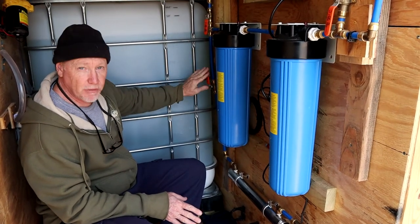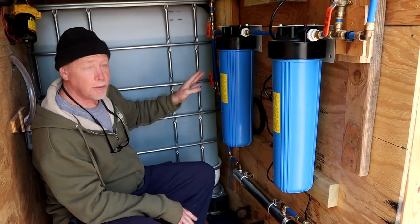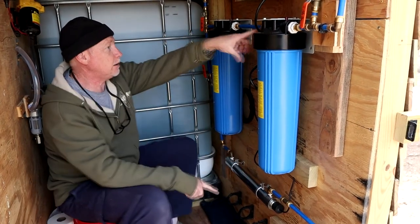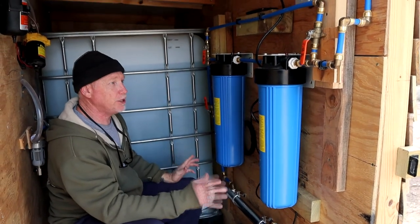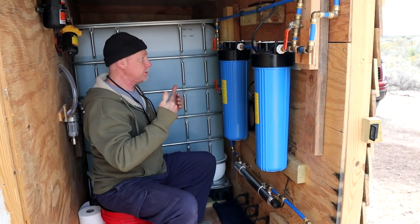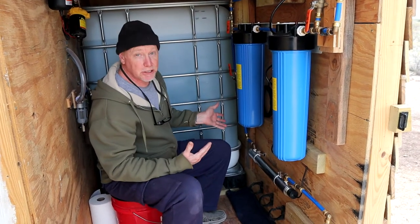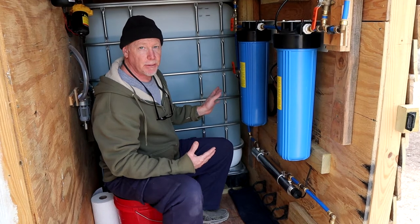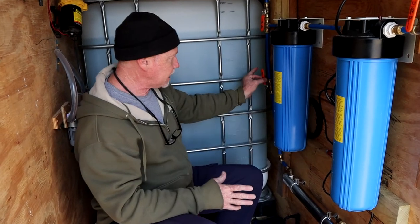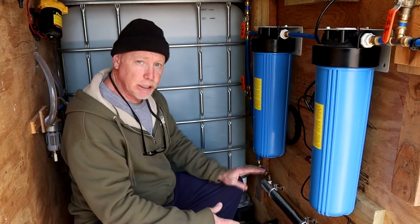As far as the plumbing, I put another ball valve in here so I can isolate this section - it wasn't there before. I'm not thrilled with my plumbing job. From here all the way up through to this fitting, all of that had to be replaced and run new. The nice thing about this half-inch blue PEX line is there's a lot of flex to it, but things are sort of floating and not blocked or braced. I'm going to let it live like this for maybe a week, then come back and add some blocking, bracing, and strapping to keep ball valves from moving.